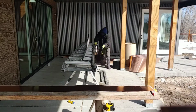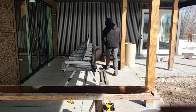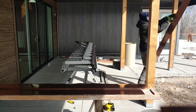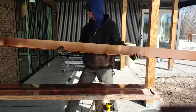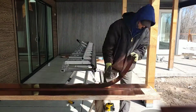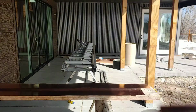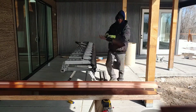What I'm doing here is I'm slitting down a coil to make the trim package I just talked about for the gable trim. And to make this work, most people just typically stick on a barge rafter cap or a gable cap and screw it down to the roof. Because I'm doing a hidden fastener system, I'm making a track that mounts down first to hold the second piece. So literally there's a two-part system that I'm manufacturing right here to hide the fasteners.